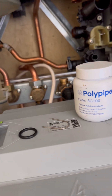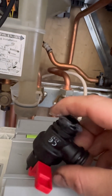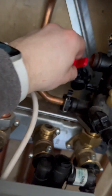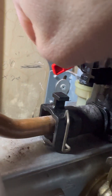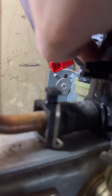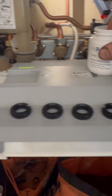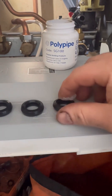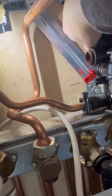There's the part number if you need it — I keep it as van stock. Then I'm going to lube up the rubbers for the PRV; the more you lube it the easier it is. It can be a bit tricky to push in — I normally line it up and then push my hand against the back wall, giving enough force to push it in. A little tip: if you've got to force that clip in, it's not in. If it just slides in like that, you know it's in. Give it a wiggle to make sure it doesn't come out, then push that securing plastic clip back up. With the plate washers, plenty of lube and then pop them into place — the lube helps keep them in place for when you put the plate in.